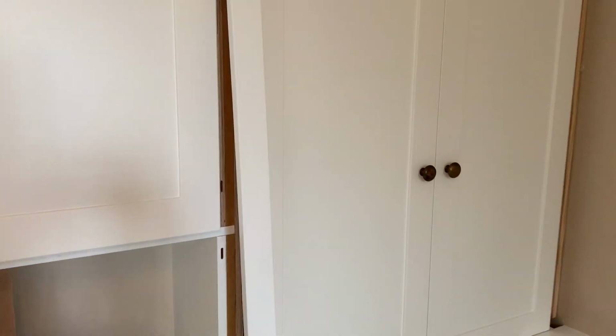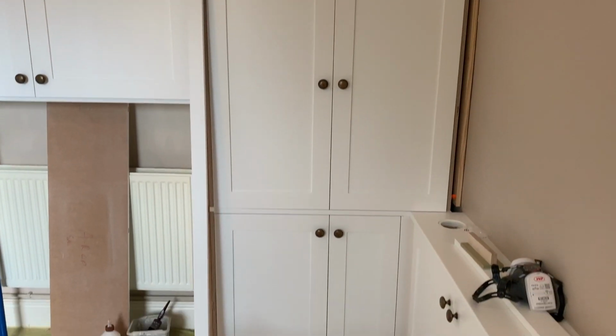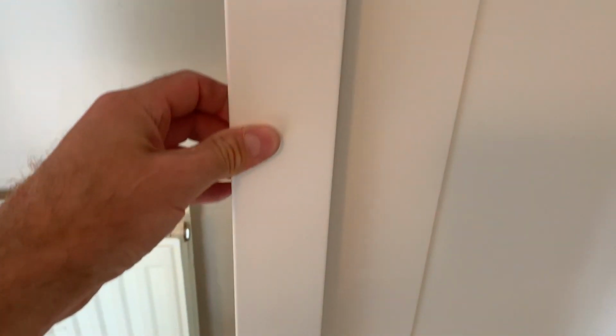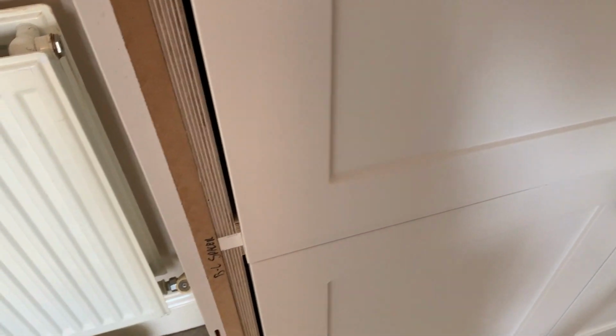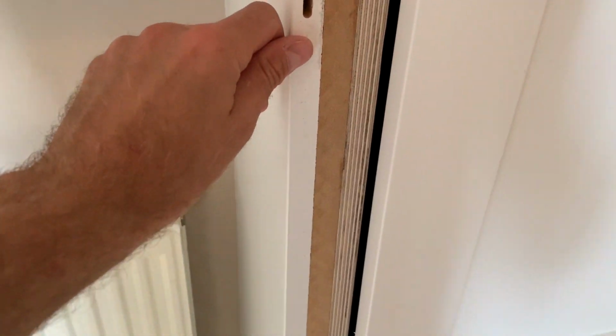Now this is a method that we've, through trial and error, settled on, mainly with our alcove cabinets. So the construction of the units here is very much the same as alcove cabinets in terms of the gaps to the wall and in terms of the cover strip arrangement where you've got your exposed side panel. So what you have is the side panel of the unit itself, which the door is hinged off. You see the hinges there. We then put a spacer, also 18 millimeters, and a finished pre-painted cover panel.